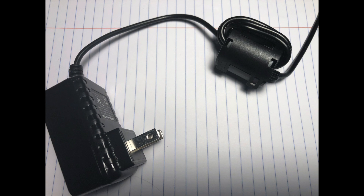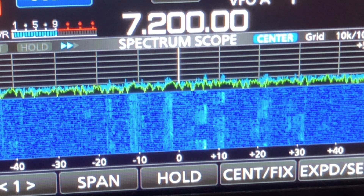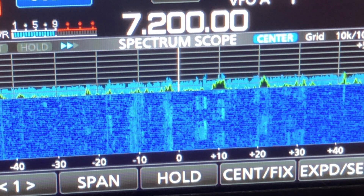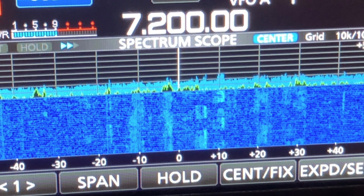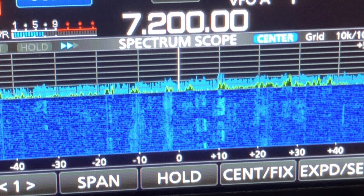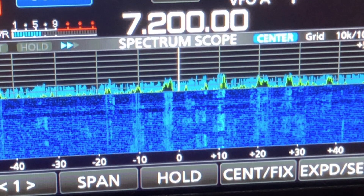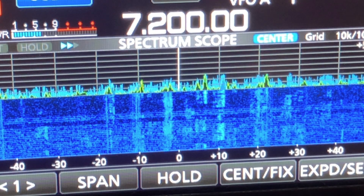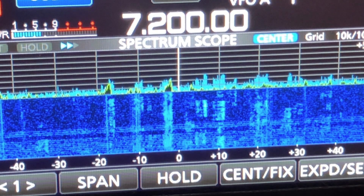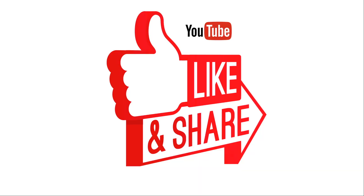Here you're going to be able to see some of the results. As I put the ferrite bead on the power cable, I was only able to get around six passes — exactly six passes. I think you want to target seven, or at least that's my understanding. Now if you go beyond seven to eight, nine, ten, eleven, twelve, the law of diminishing returns applies and it becomes less and less effective. But the sweet spot is around seven. Here you can see that there is a much bigger improvement than when we put the bead onto the USB cable itself.